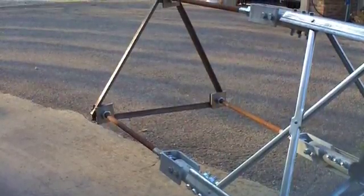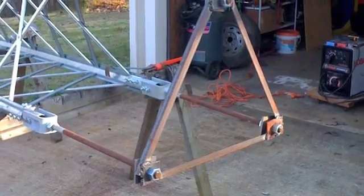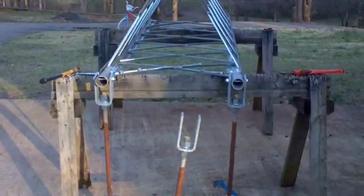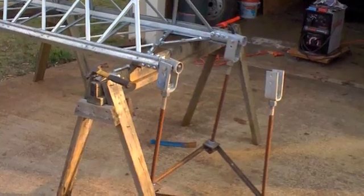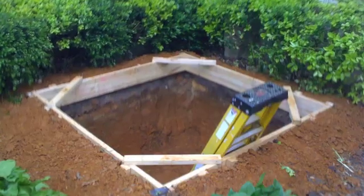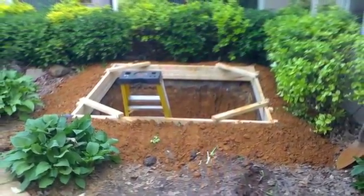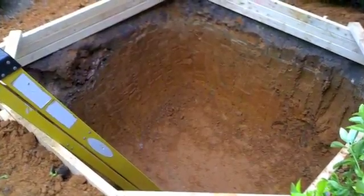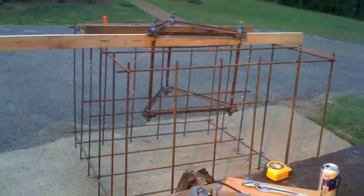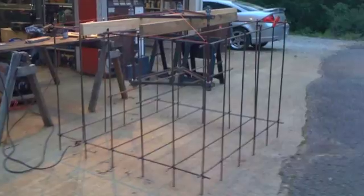Here's the first piece of triangular angle iron that I built to make sure all the bolts were in perfect alignment and held straight up. That's how the hinge mechanism works — it unbolts and allows the tower to lie down, with the metal rods sticking straight up and the U-bolts coming off. I added a little wooden framework above the top to keep it square. Then I started building my rebar reinforcement, with the triangular pieces holding the iron bolts in perfect position.